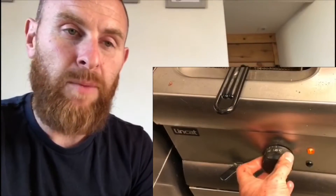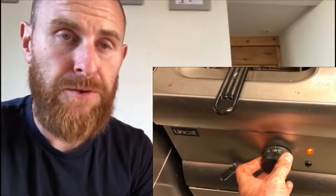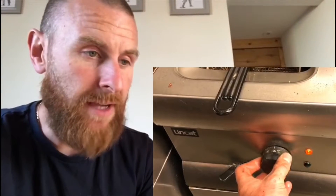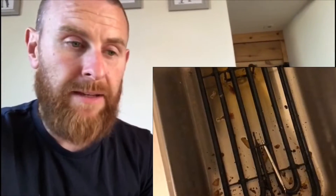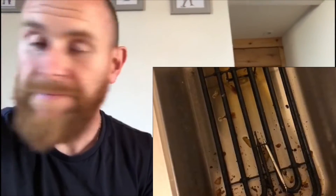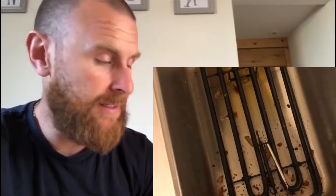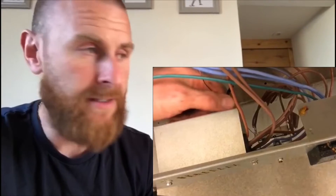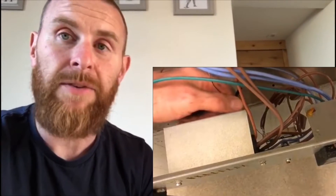I got over there and one of the fryers was working like they said, but the other side wasn't working. They were both on two separate circuits, two separate isolation switches, and two separate RCBOs — completely separate fryers just in one unit. I turned the fryer that was working on and that operated okay, but I noticed there was a clicking noise on that one. The one that wasn't working had no clicking noise. I used my voltmeter and checked the voltage coming in, which was okay, but there was no voltage going out on the output side.